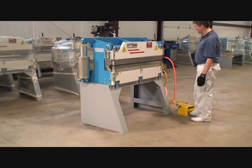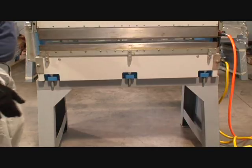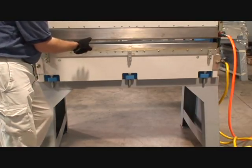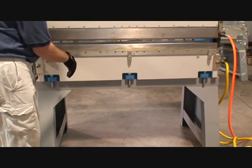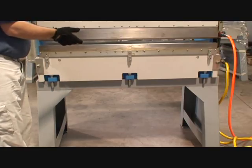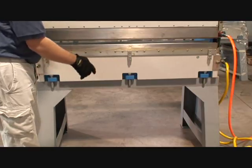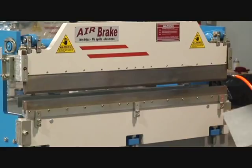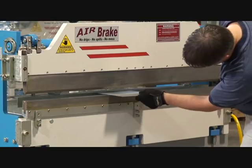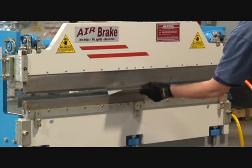All this is very usable when bending sheet metal. All the air brake models come with an adjustable bed. If you have a shorter V-die or a shorter top punch, you can adjust your bed height to match your tooling in case you don't have enough stroke to reach the bottom of your V-die. You can also adjust these to tilt your bed to allow for tapered bending — not too extreme, but for a simple tapered bend you can offset one side versus the other. To demonstrate, here's a simple bend on a piece of 16-gauge galvanized — stick it in to the back gauge, and there you go.